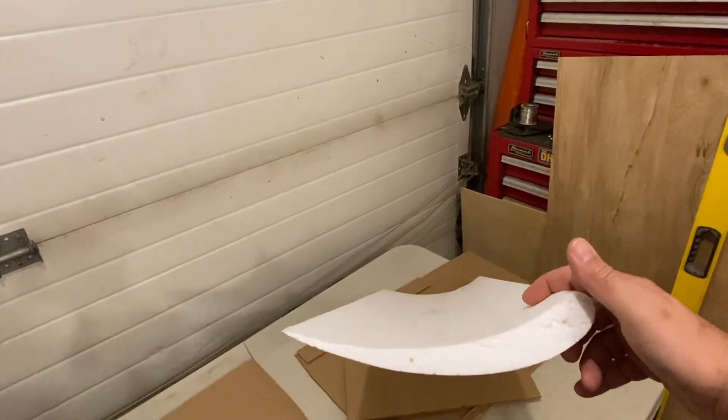Something super smooth — you have your airfoil shape and you're good. I had to cut it in two pieces, so the wing will be split in two. Each half is 32 inches, giving me a total length of 64 inches for my wing. You also have to add end plates — a quarter-inch thick each side — so I'll have a total width of 64.5 inches.